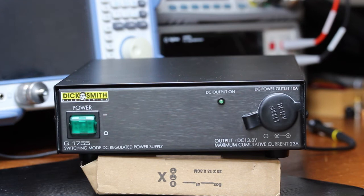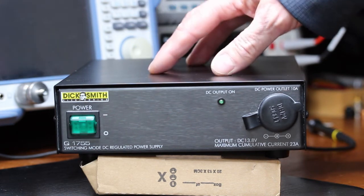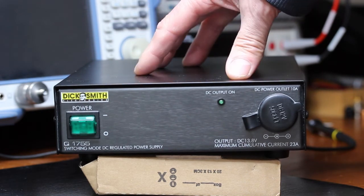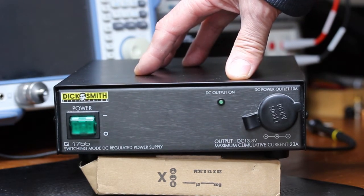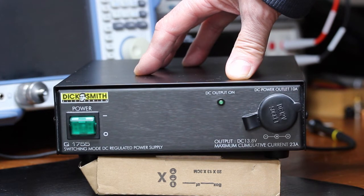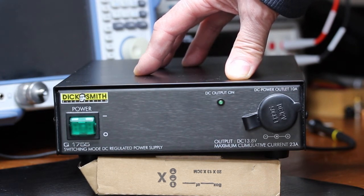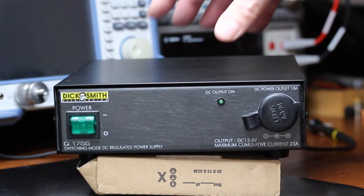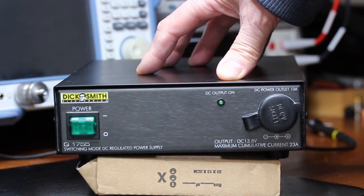In this second experiment I will do the same measurement, but now for this Manson SPA8230G, 13.8 volts, 23 amps, with a current of 21 amps to avoid exceeding the maximum power of 300 watts of the load. The ripple specified is 50 millivolts peak to peak or less.